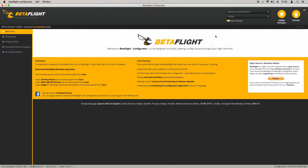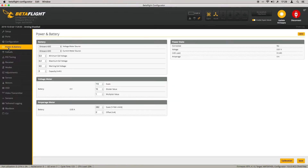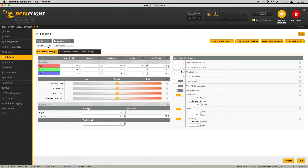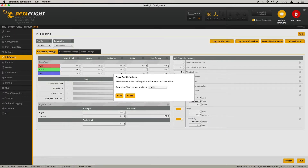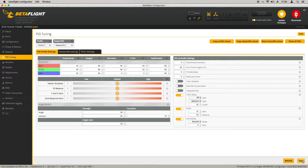Let's see how we configure this in Betaflight. Plug your quad in. There are a few prerequisites to this automatic PID profile switching with the motor output limit. First, go to Power and Battery and make sure your maximum cell voltage is set to 4.4 volts — that helps the flight controller always detect the number of cells correctly. Hit Save. Then go to the PID Tuning tab and copy your active profile to all other profiles to make sure the settings are consistent. If your current one is Profile 1, hit 'Copy profile values' to Profile 2, and also copy to Profile 3. That makes all profiles identical. Hit Save, then head to the CLI.